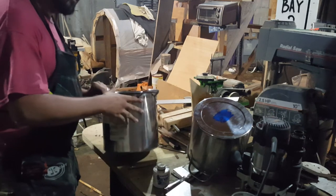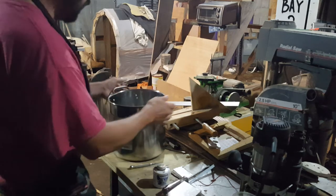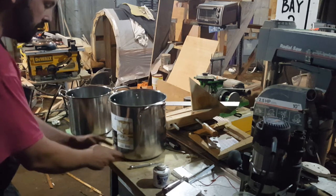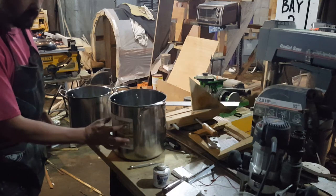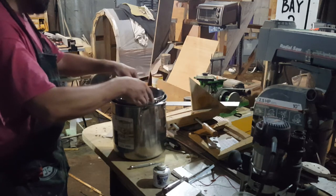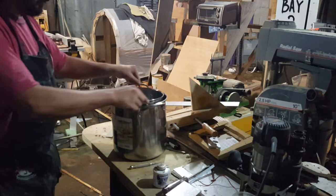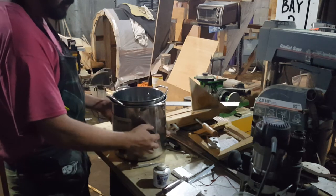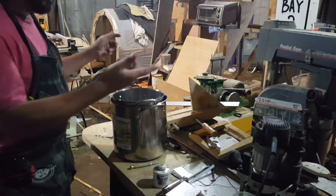Let me give a layout of how this will go together. This is the outside pan — I'll remove the handles, insulate it above the top, and cut a portion of the bottom away so that a propane burner or an electric element can go and actually heat up inside of there. This drum will go inside to be spun around. This one will be stationary, this one will spin. The whole point is to help the heat stay inside and control where it goes and how hot it gets.